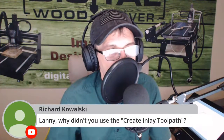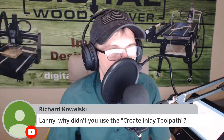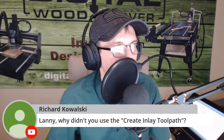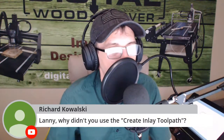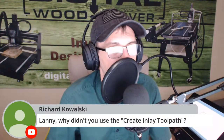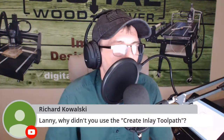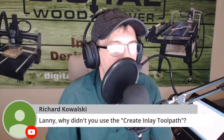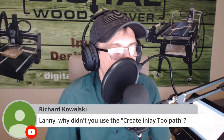But I'm working with very intricate parts that have very sharp details. Therefore, if I tried to do a straight inlay on this, let me do the female pocket calculation on this. Let me select my female part here, just as an example. Inlay, female pocket, cutting to 0.2 inches deep. I'll give it a 16th inch end mill, right? Calculate that. Reset that preview, preview that visible toolpath.